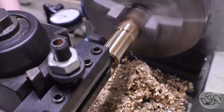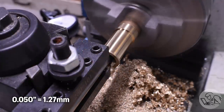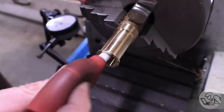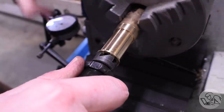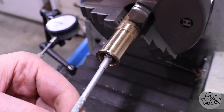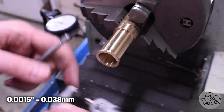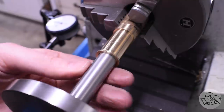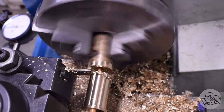This aluminum bronze drills beautifully - it's a little squealy and it heats up like crazy so I'm using lots of WD-40 as coolant and lubricant - but it does drill very nicely. I worked up to the largest drill that I have and then went in with the boring bar to finish it just like I did with the test part. This order of operations was chosen to minimize stresses on the part because the final part is so thin - only 50 thou wall thickness - that's why I made sure that the boring was the very last part, because that's the lowest tool pressure of all these operations. Now with a little deburr, I'll check my final dimension with the telescoping bore gauge, aiming for about a thou and a half over my crankshaft size. I did hit that, and that crankshaft is a beautiful fit - slides right in, no play, but it spins freely. Very nice. A little deburring and I can part this off - and yahtzee!